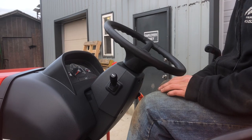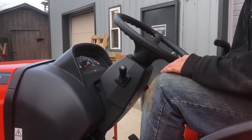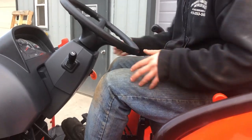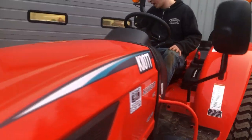Right now I'm going to show you — if you don't need to use your tractor, put your parking brake on and put your tractor in neutral. Most tractors have to start like this anyway, so pretty much just leave it how you'd start it: neutral, parking brake. A couple tractors have multiple shifters — if it's a gear or a shuttle, make sure everything's in neutral with the brake on.